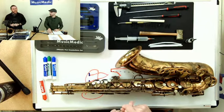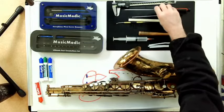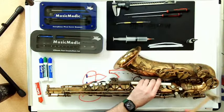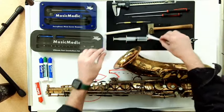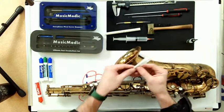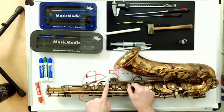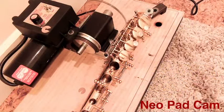Let's talk briefly about the tools we're going to need. Typical things like a screwdriver or a spring hook. If you do need to do some post alignment, this is my preferred method — with a little knocker and a rawhide mallet. You have things to clean out the post after we counterbore — we could have little brass shavings, so a pipe cleaner to clean it out, and obviously oiling and greasing it up afterwards. If you have a caliper, it makes it very easy.